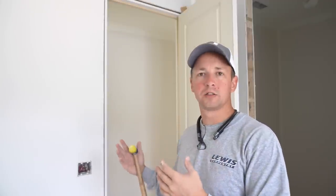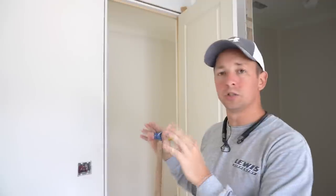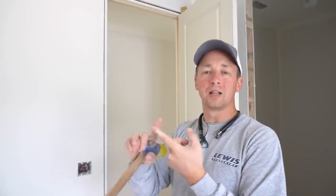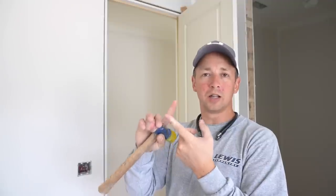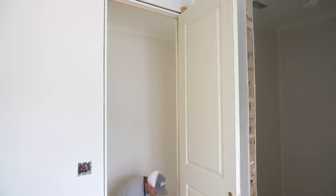Whenever you nail something, it still has room to move. So if you're just starting out setting doors, don't be afraid to tack something and then beat it around a little bit. With tacking it in place — yes, I have nails at the top and bottom — but a little persuasion with the rubber end of my mallet and I can still move the jam around. I don't want to put in so many nails that I can't move things around before I'm ready for it to be permanently attached. Now that I've checked my latch alignment and confirmed the door is closing nicely to the doorstop, I can move on to actually nailing this off.